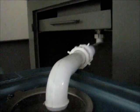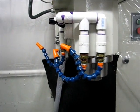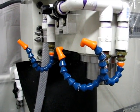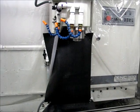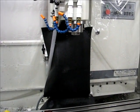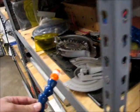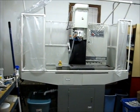I just need to increase my capacity for the coolant return. With this setup — 1/4-inch lockline with 1/4-inch nozzles — it should be more than adequate. This is plenty of coolant flow as of right now. I haven't had any reason for more, but I did some testing where I have an option to go to even more flow by using 1/2-inch lockline and 1/4-inch nozzles, getting about 500 gallons per hour out of this system.